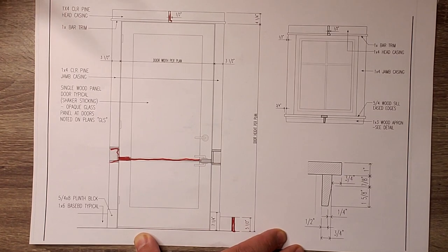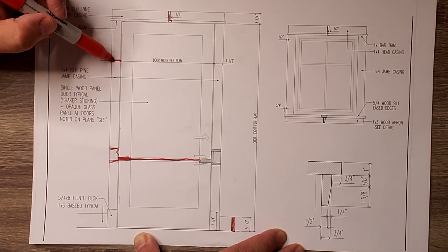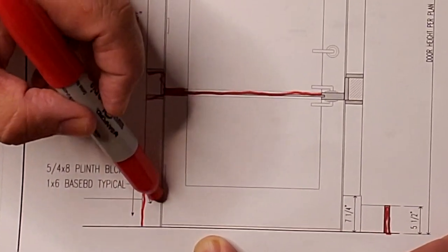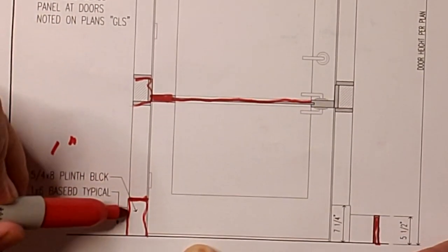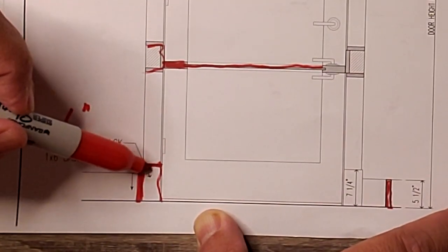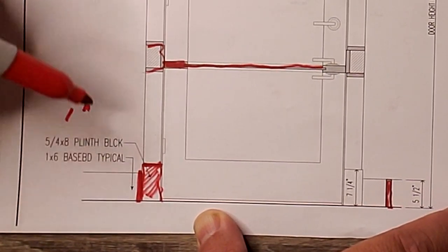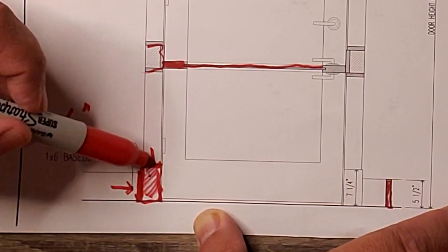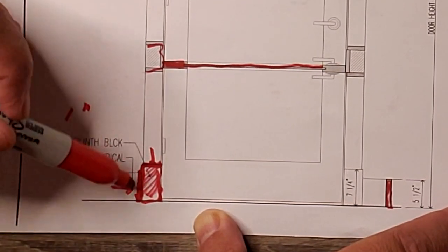This house is going for a more contemporary feel, warming it up by using vertical grain Doug fir. Everything is pretty simple square stock — the casings are one-by-four, which is three and a half inches by three-quarters. It's a square casing that comes down and sits on a plinth block. The plinth block is five-quarter, meaning one inch thick. The reason you do that is it gives you a little reveal on each side — this is a bigger piece than the two pieces coming into it. So if there are any irregularities in the drywall or plaster, you can put this larger block on and everything sits inside that edge, so there are no coinciding planes, making for easier setup.